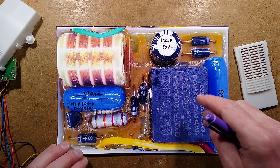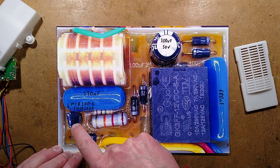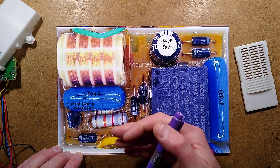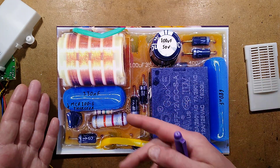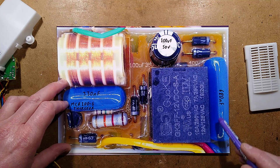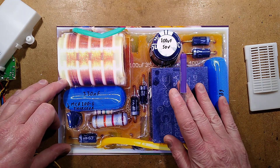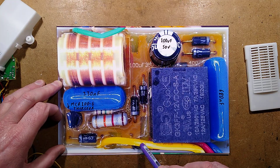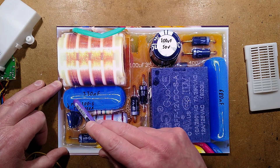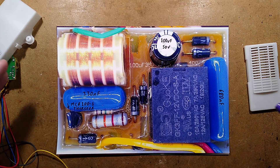I've kind of worked out what this bit's for — it's a guess, but I think it's a safety latching circuit. This is using the thyristor here in the most bizarre way I've come across, using a characteristic that is not an official use case, just to absolutely minimize the component count. It's a relay with a capacitor forming a capacitive dropper with four diodes and a smoothing capacitor just to power the relay. The separate section only shares a common neutral and has just the high-voltage transformer for the tube, the capacitor discharged through that, a thyristor, two resistors in the trigger circuit, and a diode for rectification.